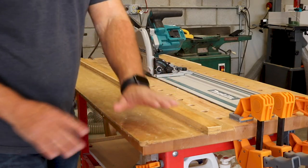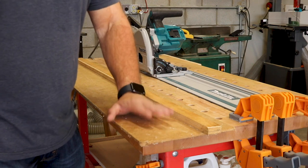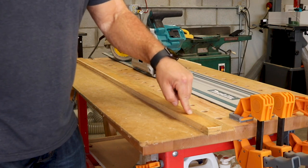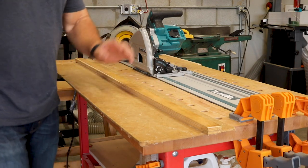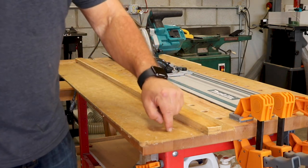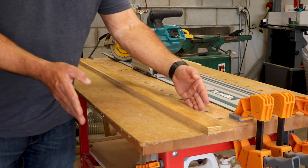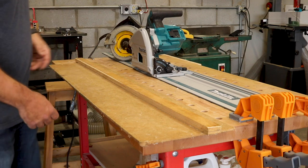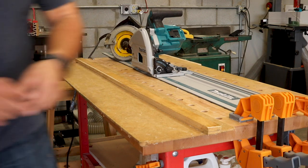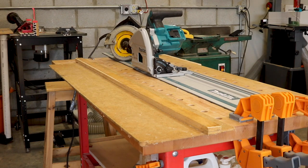Real easy concept. Just need a piece of quarter-inch material — MDF, plywood, whatever — and then a three-quarter inch piece of wood on the top, about an inch and a half wide. When you attach your piece to the quarter-inch ply, you just need to make sure that this is good and wide. I'd start out 10 or 11 inches at least. Mine is around nine and a half inches, so if you keep it about 11 inches, that should give you plenty.